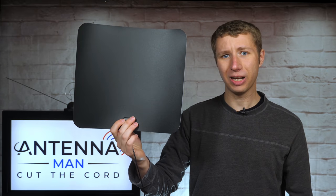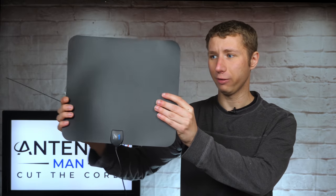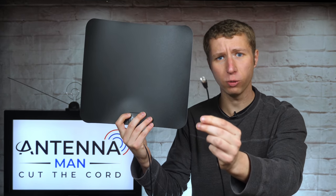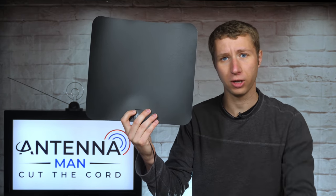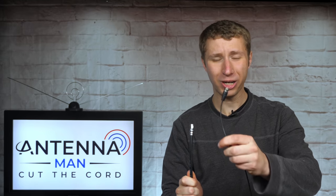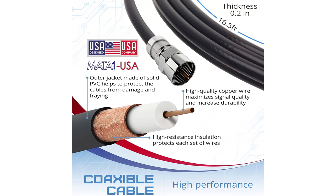The design of the antenna is a little bit flimsy — it's kind of curved in a bit, like if you try to straighten it out, it just folds back in. It has a hair-thin cable that's going to result in signal loss or easy interference. In a previous video, I demonstrated how the coax cable can have a huge impact on reception. With an antenna, it's best to use a thick, high-quality RG6 quad-shield cable — not like this — and because the cable is built into the antenna, you can't replace it. What's ironic is the company showed a picture of what looks like a quality coax cable on the Amazon page, yet the antenna comes with one that can't even stand up on its own.